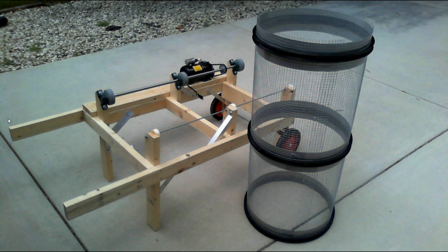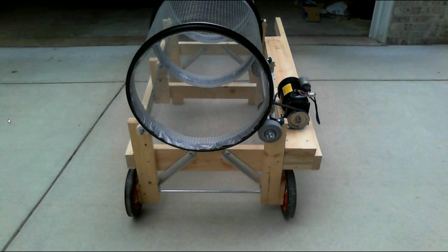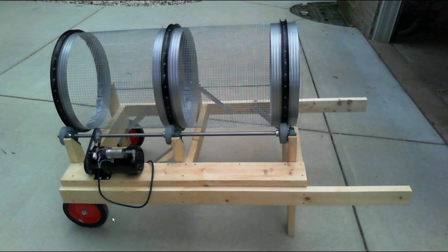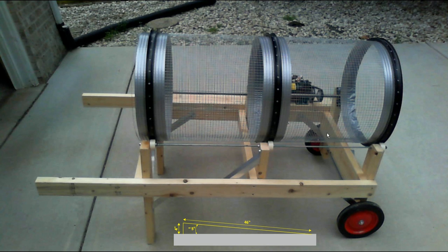This is a low-profile, portable rock trommel. It uses an electric motor with a reduction gear. It has two handlebars, three drive wheels, and three idle wheels. The idle wheels also hold the drum in place, and the drum sits at five degrees horizontally.